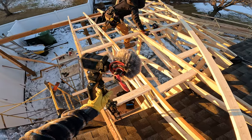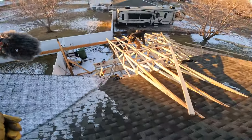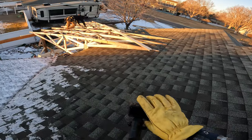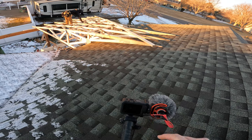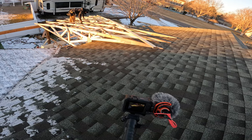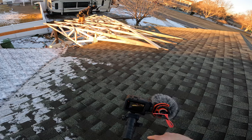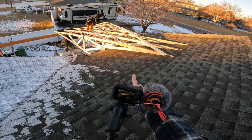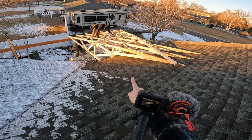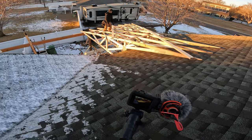Is your camera rolling? So here you can see we're sitting just over an inch, inch and a half above our roof here. We've got to run a two by eight across there under these points. We'll tie into the existing roof — our trusses are designed so there is no weight load on this roof. You can see this bottom cord here, it transfers down into that, which transfers into our ledger board on the side of the garage.